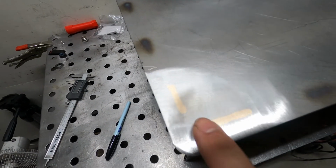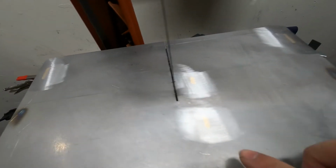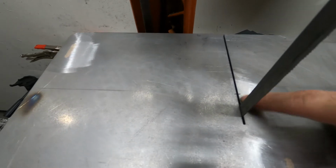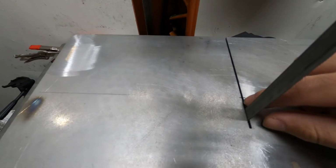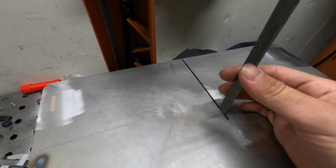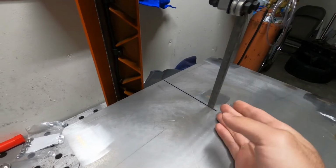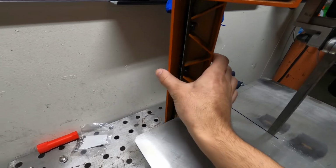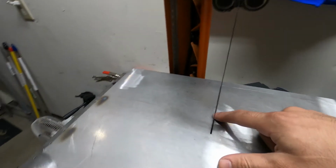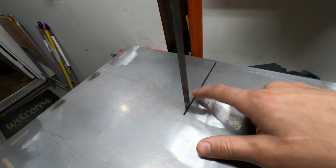Alright, I'm back. I got the grooves here, I got the notches filled up with silicon bronze, and I just finished grinding them down, all of them. So next up, I already went ahead and marked just a general area of where I think the bolt location is going to land down there. So now I'm gonna drill a hole, see how well it lines up. I have this as squared up as I can. It's kind of tricky since the blade is a little finicky to get it squared, so I squared it up on the bandsaw itself. So I'm just gonna drill a hole, and then I got a special tool to, what's it called, undercut it? I forget, look it up right now, but I'll drill the hole and then we'll move from there.